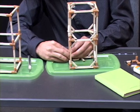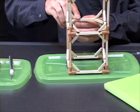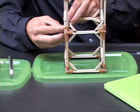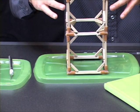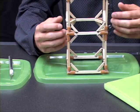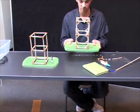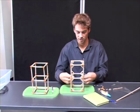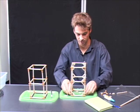By adding these trapezoids, we form triangular elements in the building. As you can see, it's triangular shaped. And these distribute load throughout the building and strengthen it. As we can see, when the building has been strengthened, when you attempt to shake it, there is really no shaking at all. If you pop all these supports back out quickly and easily,